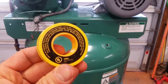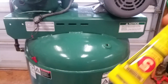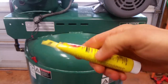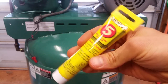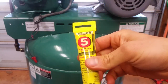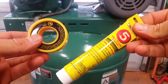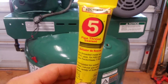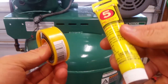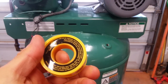I'm going to seal this thing up with Teflon tape — this is the high-density stuff, the gas yellow kind — and pipe dope. First I'm going to put the tape, then I'm going to put the pipe dope. I know some people are going to say just use pipe dope, just use Teflon tape, or silicone it, but I don't care — I've done this before and this works for me. This is yellow pipe dope; I normally use the white Teflon pipe dope but I used this yellow one and people said it's good. I've used just Teflon tape before and it leaks.